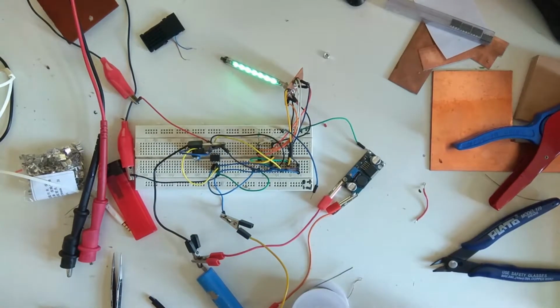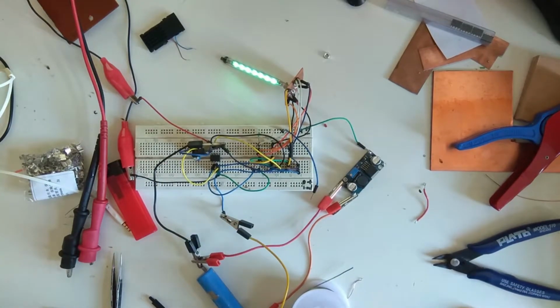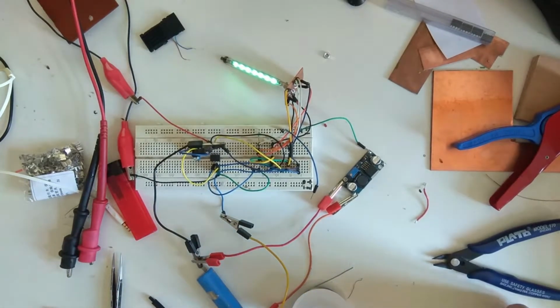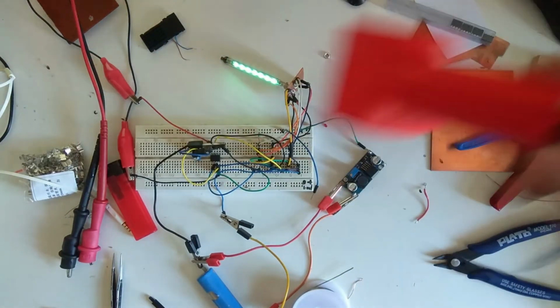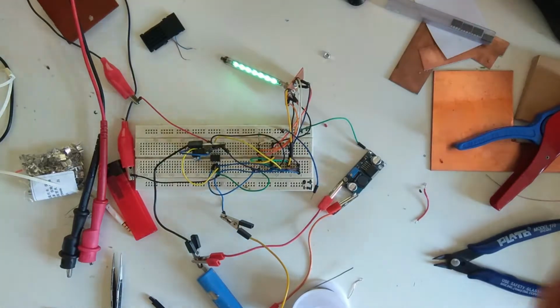I will not put a cutoff in. I will not make it just cut off. Because if I have a flashlight, I really want to have the option to ruin the battery. If I need the thing right now, and I don't care about losing a $3-4 battery, I'll just go for it. It's a flashlight. It's possibly used in an emergency type of situation. And the worst thing would be if the thing just cut out. I'm the sort of guy who likes manual overrides, but I don't want to put a second switch on it, so it's just not going to have a cutoff. And if you want to risk it, you could drain it further, but it would be really better if you switched it off.